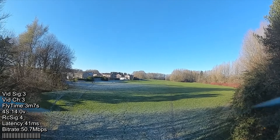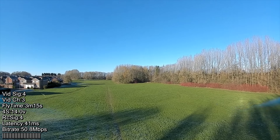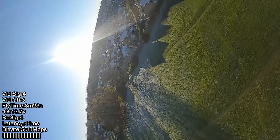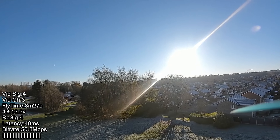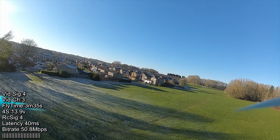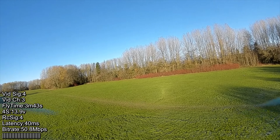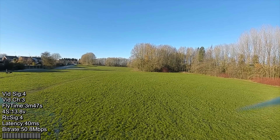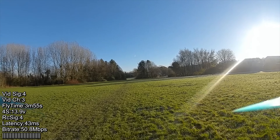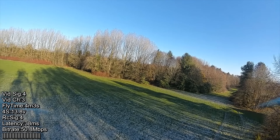It makes it around there fine. I did get a signal warning for a brief second but didn't notice any jitters. I've gone 16x9 on the camera because there isn't a true 4x3 camera for Walksnail — the 4x3 mode just cuts the edges off, you don't get the full vertical field of view. So comparing both in 16x9 is fair. Looking at the compression when we get low to the grass in 50Mb mode on DJI, it's not too bad but still there. What people like about Walksnail is that it's somewhere in the middle — you retain more of that sharpness.